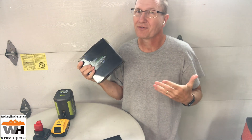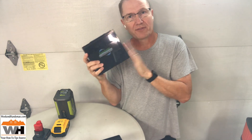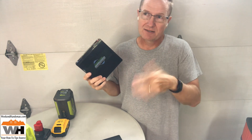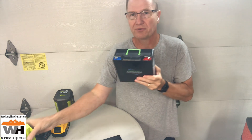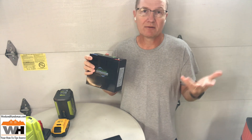If it's running through an inverter, you have 345 watts — let's round it to 350. If we run it through an inverter, we're going to lose about 15%. So let's take that at roughly 50 watts gone, meaning this battery through an inverter would give us approximately 300 watts to use. So if whatever our draw is, is 100 watts, it would be able to power it for three hours. If our draw is 50 watts, it would be able to run it for six hours.